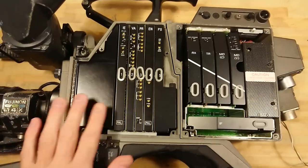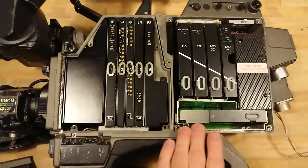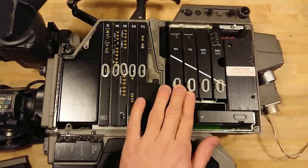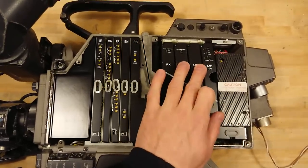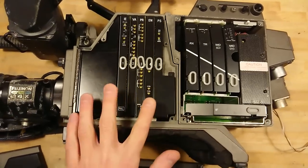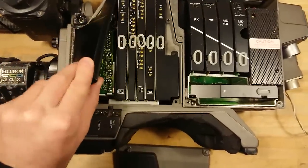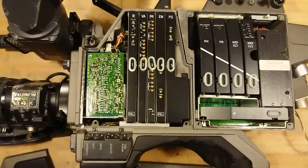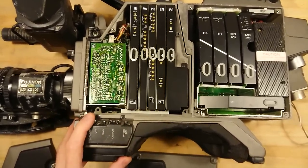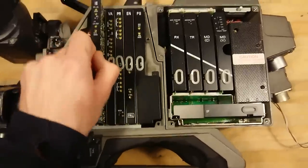I really looked forward to showing you what's inside, because it was absolutely nothing like anything I expected. I did not expect to find a small rack-mount computer inside a camera — but here it is. Small, beautiful cards, all custom tasks, with a little CPU board sitting at the bottom. There is some audio for the intercom amplifiers, another card that says red, green, blue — perhaps a little test pattern generator — and over here everything that has to do with the sensor for image generation, hiding behind a little black cover. Here we can see the two PAL cards, as this is a European camera.